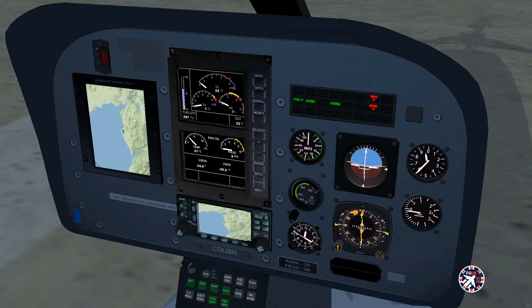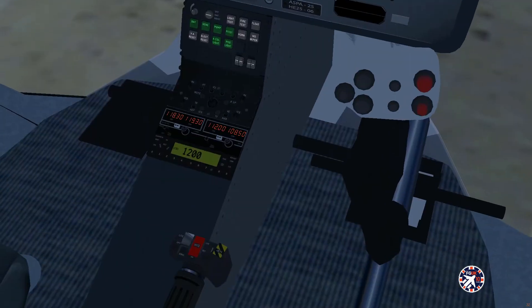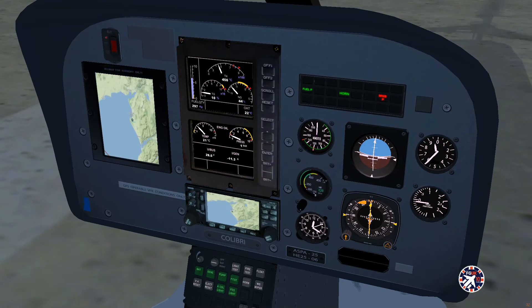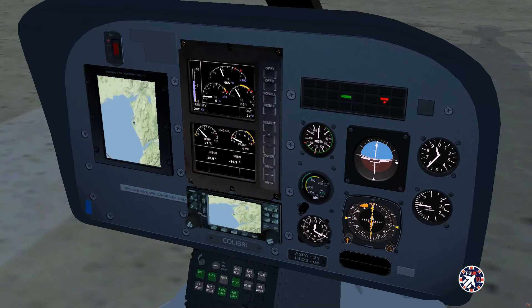Now we are watching the NG percentage — let it rise, let it rise. There we go, stable. We'll start her off now, and that should be better once we go to idle. There we go, risen up. That stabilizes and will run at about 63% on the ground idle.